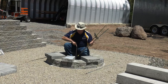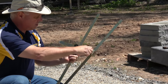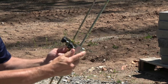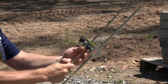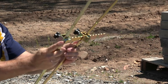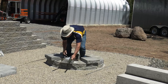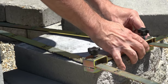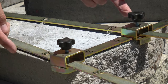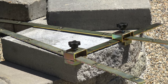I'm going to adjust it now because I know from my center pin to my face I'm 25 inches, and I want this at 27 inches. All these notches are an inch apart — you can also choose a measurement in between. So I go 24, 25, 26, and 27. I can tighten it down on one side. I can slide these notches, and underneath I have these 90-degree angles that I can lock right onto this unit and then tighten up. I've locked these corners in, which gives me the exact taper needed to make all exact caps around the entire fire pit.